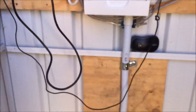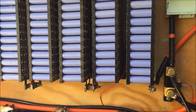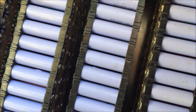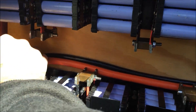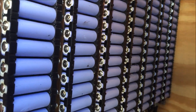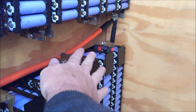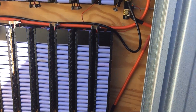Still doing 100 amps. There's no heat in any of those cells and no heat in any of the connections. I just went through it all and tested every single arm. There was no really low readings, other than that one there which we know has got an issue and I haven't changed that yet. But there's no heat in any of the connectors - nothing. I'm really happy with the way that's going.